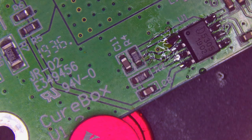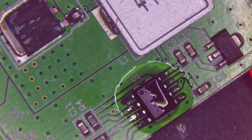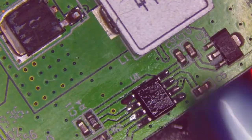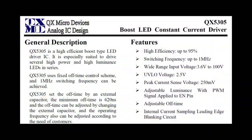The punchline is that this chip did turn out to be the problem. When I swapped the one off the good board onto the bad board, it rescued the bad board, and I'm able to source these from eBay for about a dollar a piece. The chip is QXMicro 5305, as you can see the marking there. So I'll be able to repair the now unpopulated board and get both my printers back up and running.